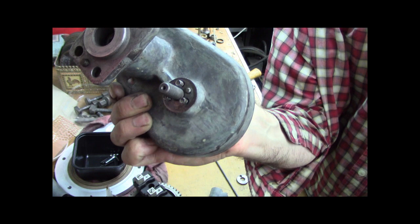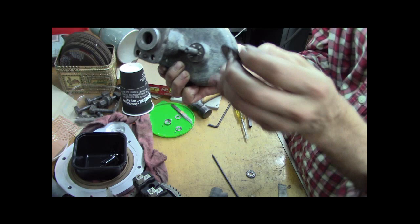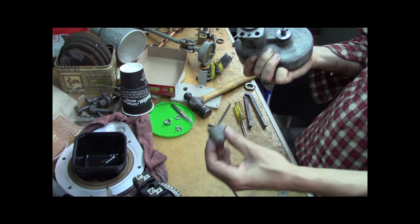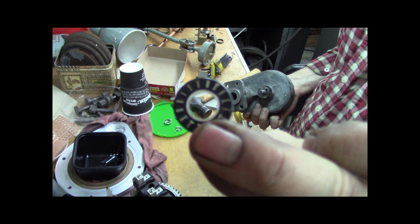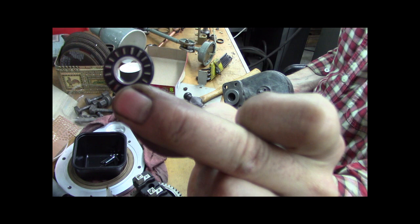And you got this thrusty, trusty washer there with a hole. Now the hole is for the pin, right? So that's the deal. And the handle knuckle, look at that, bronze goes on the threads and tightens it. But I made a thrust washer. I have a needle thrust bearing, and the bore was like 0.515. Or it was like 513. It's probably for a half inch shaft.